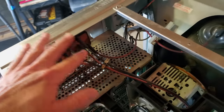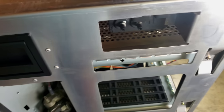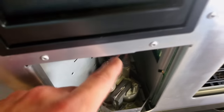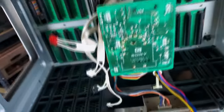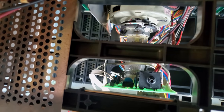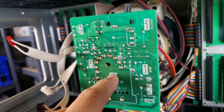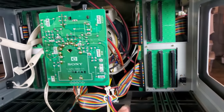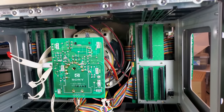These lines go into our flyback and ultimately into the neck of the CRT, controlling focus. There are two potentiometers for focus controls that you can tweak to adjust the sharpness of your tube. Here's the flyback assembly, and leads off of it help with main convergence control. There's the horizontal static convergence adjustment pot on our neck board, which the rest of the cables go into. The neck board sends picture information telling the tube what to do — when to fire each gun and how intense to make each spot. The slot boards are where your cards go, including the power supply, deflection, and input board bays.